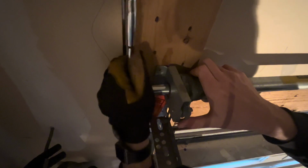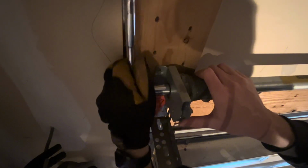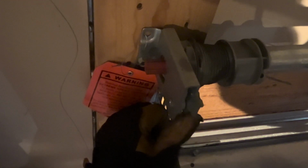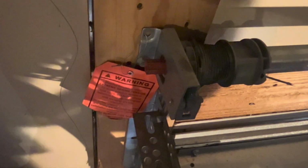In my instance, this is a 7-foot door, so this is going to be 16 full turns to loosen and even to tighten this up towards the end. All right, and once you've got the tension released, you can just push on that, make sure everything is out of there. It does get easier with time as you sit and loosen that up.